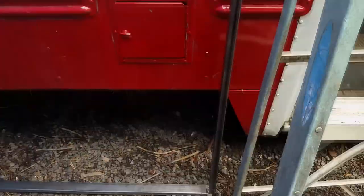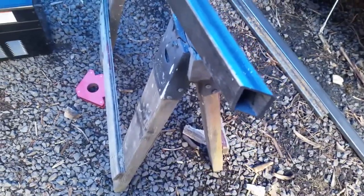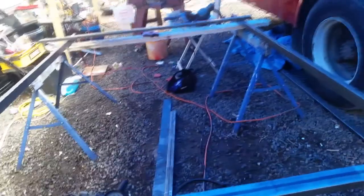Here's the one piece — kind of a before and after. I'm making two of these, and this will be either the top or the bottom rail. I've laid these out and I'm going to take my grinder and grind these edges where I'm going to be welding. I'm using magnets in the corners to hold everything together, and then I'm using a square. The final check is you measure the corners diagonally — if they measure the same diagonally, you've got a square frame. You keep messing with it until they're equal, then weld it up.